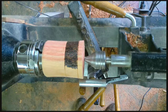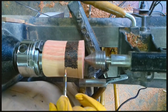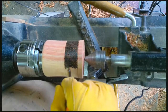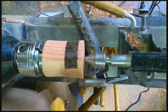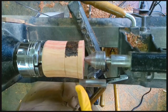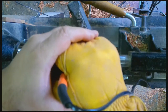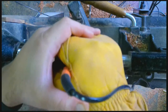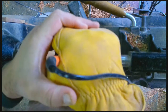Sue, I am making a shaving mug, and right now what I'm doing is pyrography. I am giving it some texture on the band where the handle is, which is carved, not turned, because there's a handle there. And when it's spinning around at 1,000 RPM, I can't stick a tool in there. So this band is just a tiny bit wider than the handle, and is not perfect because it's carved rather than turned, so it doesn't blend exactly perfect. So I'm texturing it to test out a technique and also kind of disguise the fact that although it looks pretty good, it's not continuous. The curve is a little bit off because it is hand carved.